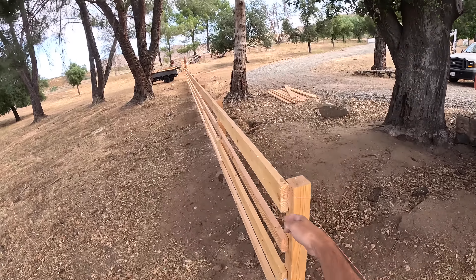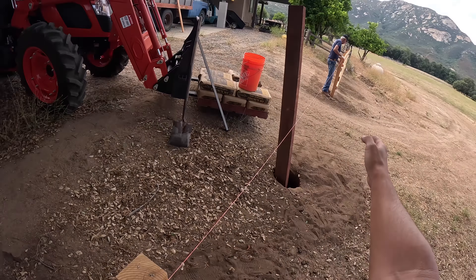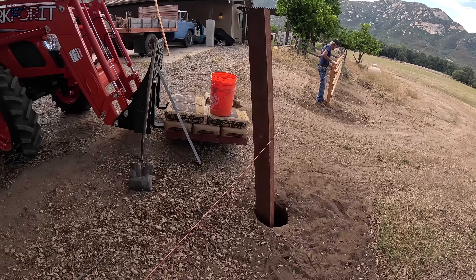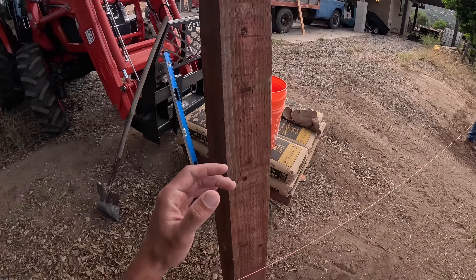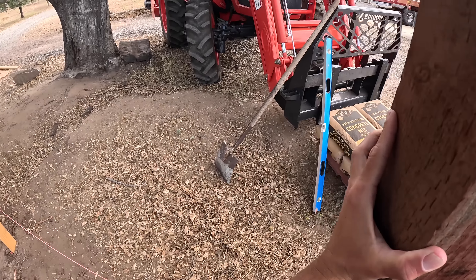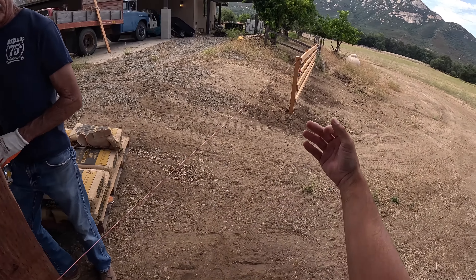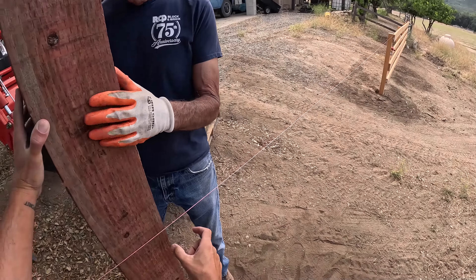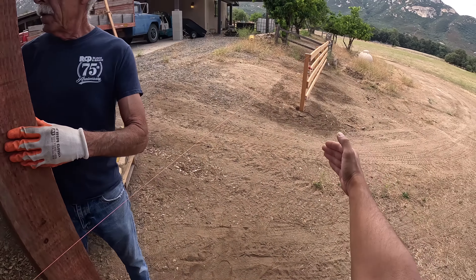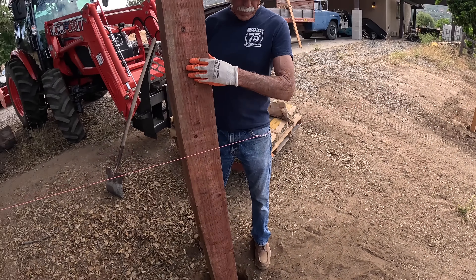To keep in line with where this fence is — because we strung this all at one shot — we're just running a string line right here. Then we'll make sure that once we plumb up the six by six, it works out to be right on the edge of this line. We also have to account for needing a 16-foot opening. Even with a 16-foot gate, they account for the space of the hinges, so 16-foot exact opening means the gates end up being a little bit smaller to account for hinges and all that.